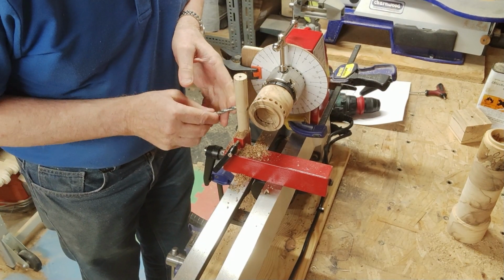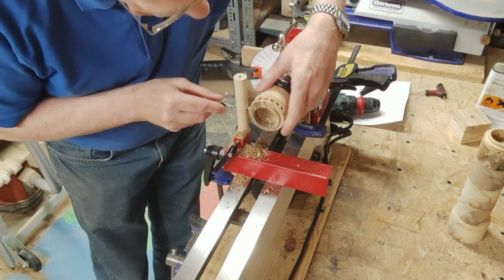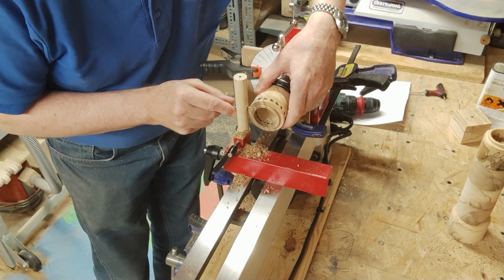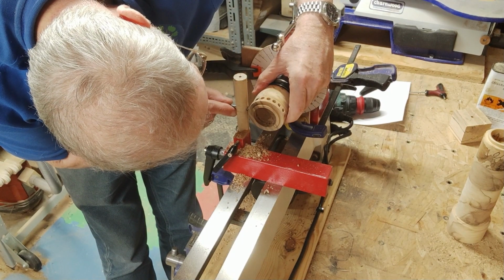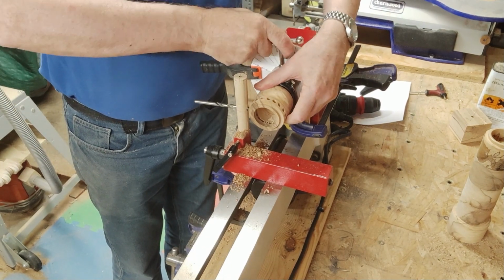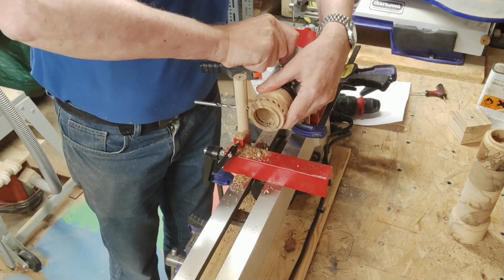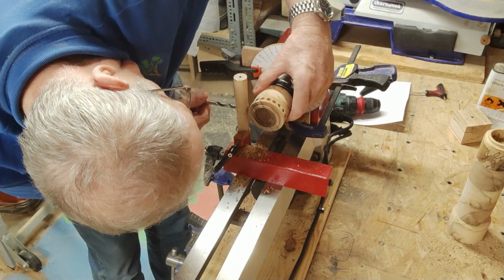By releasing the grip of the chuck jaws, I can slightly rotate the tea light holder independently of the indexing disc. I then rotate the holder by half the gap distance between the present drilled holes. I can then position the drill on the second line I drew in order to drill the second row of 12 holes.